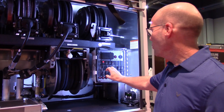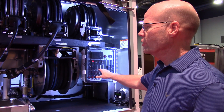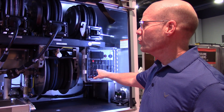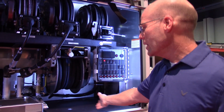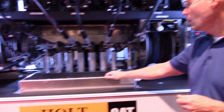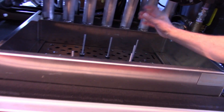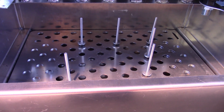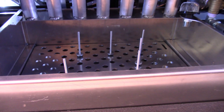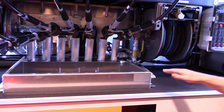They're on demand, so basically at this point you just flip on one or multiple kits that you're going to want to pump, and they go live. Basically just grab and go then with your meter dispenser. We do have a nice filter bin here that they can lay the used filter cartridges down for draining, and that is set up to recover from the evac system through a ball valve that can load that into the evac recovery tank.